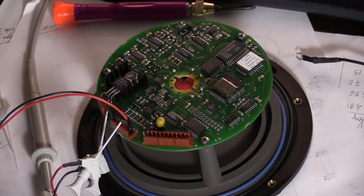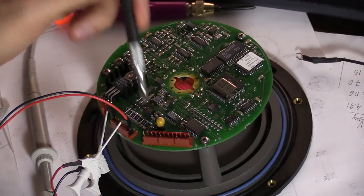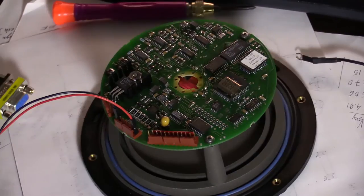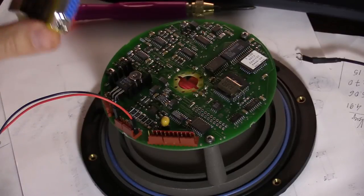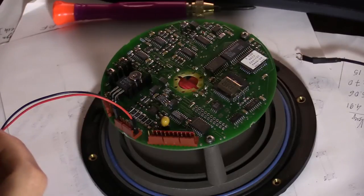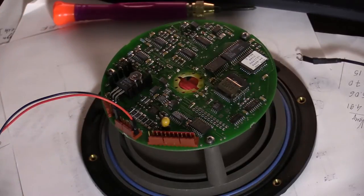There is some output protection circuitry along with an optical isolator made by NEC. I'll connect an RS232-to-USB adapter made by FTDI to this board and see if I can get something legible out of it. According to the RS232 pinout, pin 5 is ground.